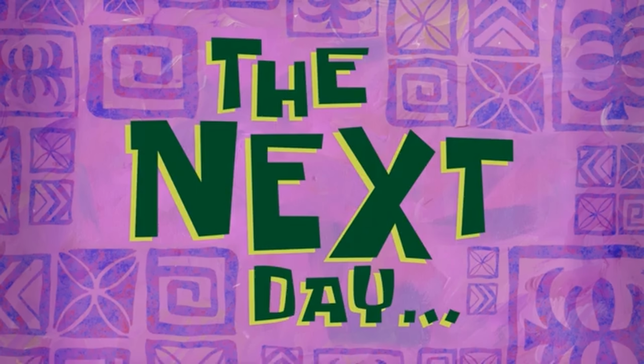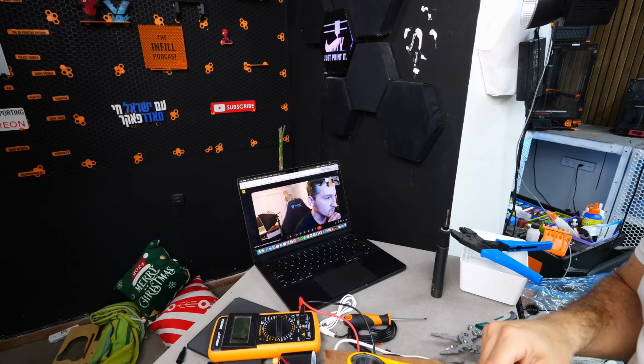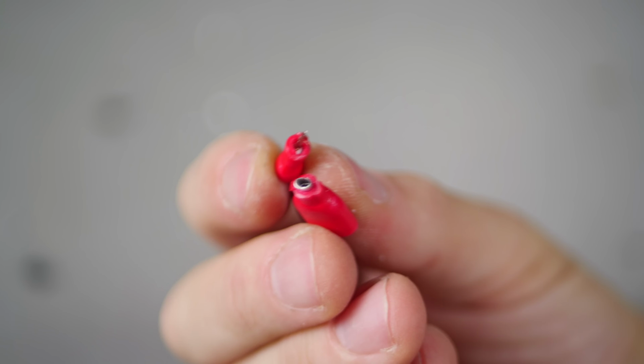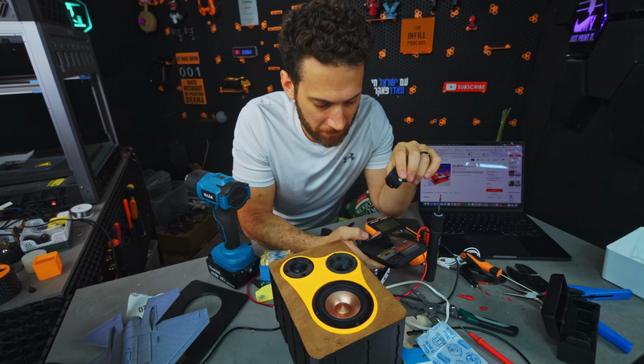The next day. All right, guys, good news, even if it is a little bit embarrassing news. The issue is actually not my solders. I spent about an hour on the phone with Justin. Thank you, Justin. And we diagnosed everything. And in the end, it was just my crimps. I had crimped onto the wire sheath and it wasn't making proper contact. But now, check this out.